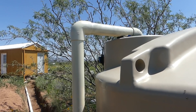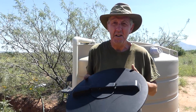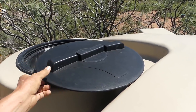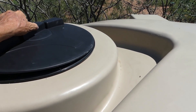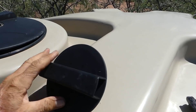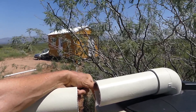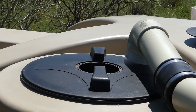These fantastic water tanks from Oasis Water Harvesting come with a screened grate to keep all the crud from falling into the tank, and also a centerpiece that screws out and allows me to fit my pipe right into the cap. At first I decided to put the black rubber Fernco joiner in the middle of the horizontal section of the stack, but after thinking about it I didn't think it was that sturdy. So I changed it up and decided to put it in the vertical section of the stack.